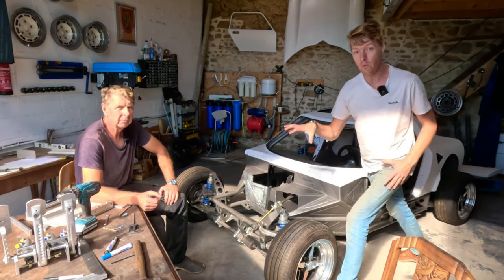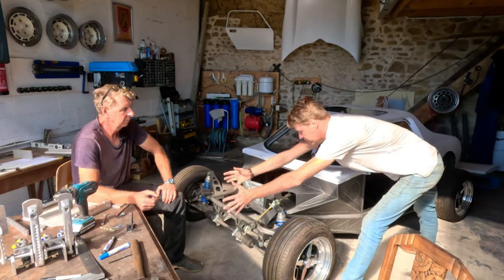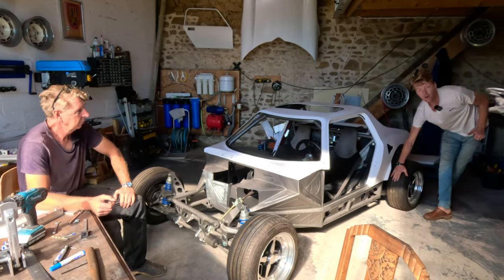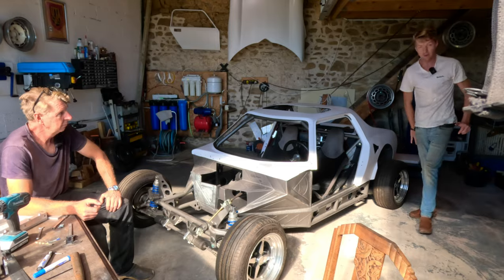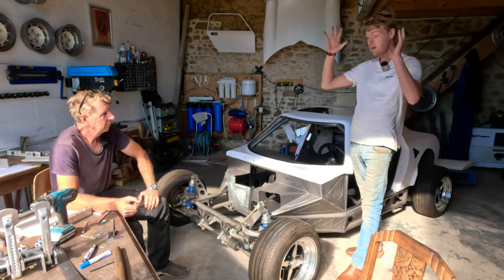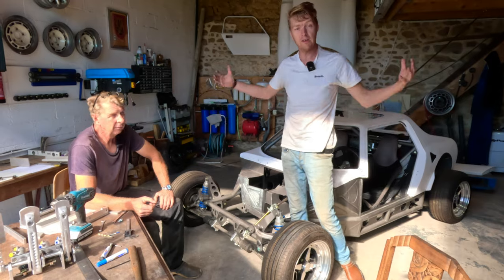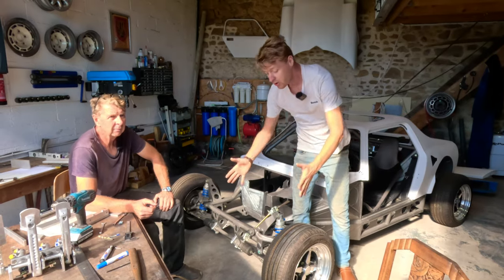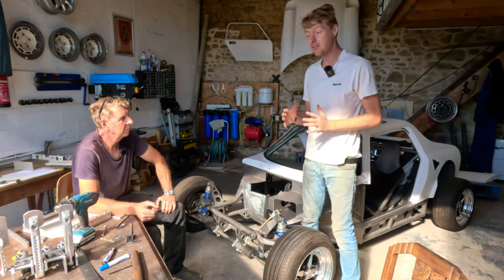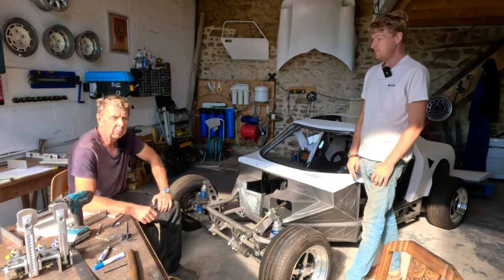But our cooling system works exactly the same as the de Havilland Mosquito, where it pulls air from the front of the car through here and then fires it out along the side of the car, covering up our rear arches. So the fact that we've got curves doesn't matter as much aerodynamically. And not only that, but because you're sucking air from the front of the car, you're effectively reducing your frontal area according to the wind. So even though we've got wide arches, we will be more aerodynamic than if we just had smooth, flat, straight bodywork. Yeah, so that's why the pedal box is so small.